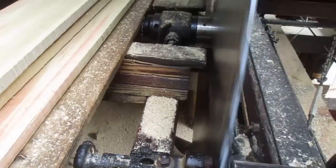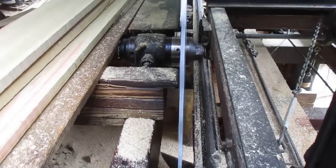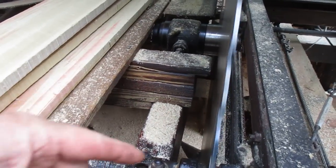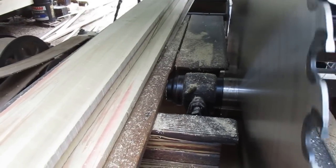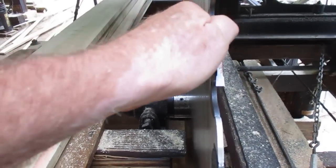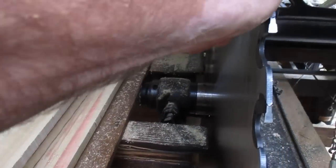Well, I think I might loosen the blade, back it off, pull it out of the pins and turn it 180. First, I'm gonna mark where the high spot and low spot is. Like I said, you can see two spots in that mandrel. There's the one coming up. See the Allen set in it? And look at this stuff that still hadn't come off of there. Boy, there's a dead animal back here. See the other Allen set in it up there?